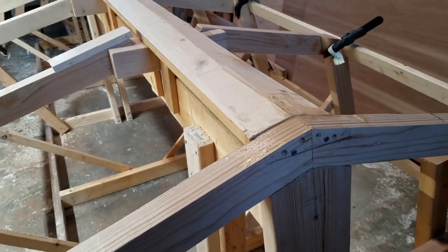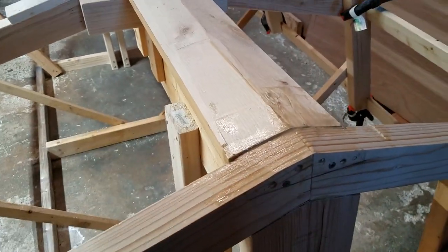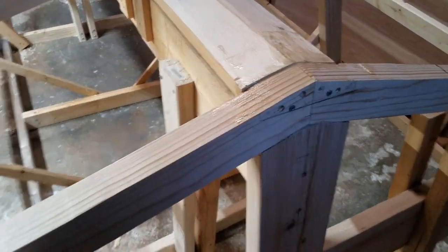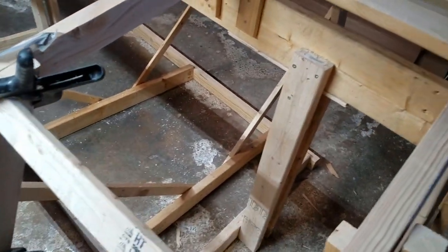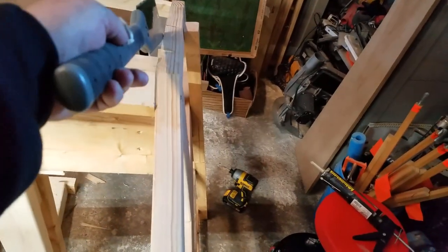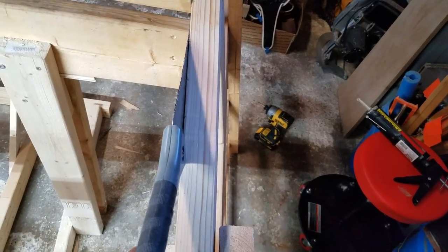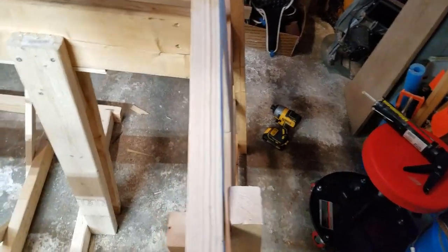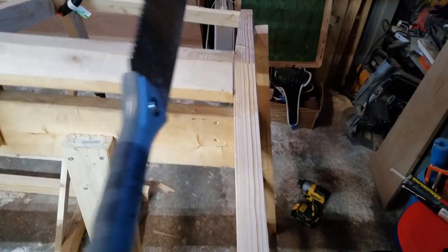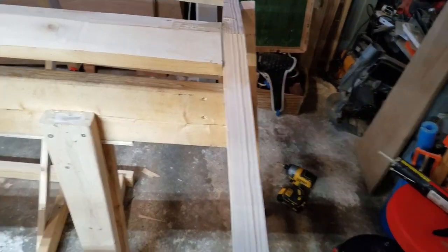Problem I had is the transom was too much over here to the left. I didn't have it measured just right, I guess, when I put it up. And so what I did was I took out my handy dandy Japanese knife and I came over here and I started cutting it off. So I tried to go with the 10 degree angle of the transom, and cut through the keelson. And instead of cutting at that beautiful angle, it cut at this angle, and it had a little bit of wood messed up in there.